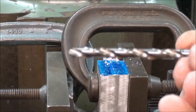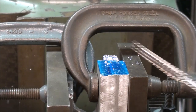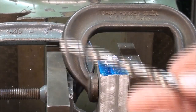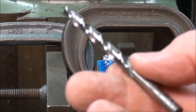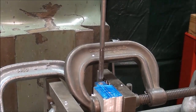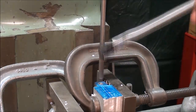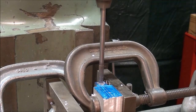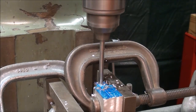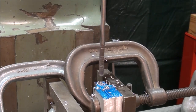Now I'll put in the 15/64ths drill bit and drill all the way through in preparation for the quarter-inch chucking reamer. It's typical that you would drill one sixty-fourth under the ream size, so that's why I'm selecting the 15/64ths. I won't show the drilling — I'll skip right to the reaming. I've got a quarter-inch chucking reamer. And that quickly, that hole is reamed, and now I move on to the larger one.